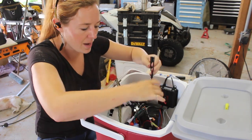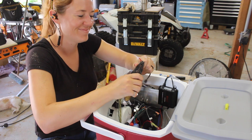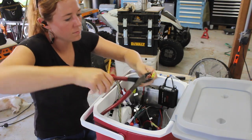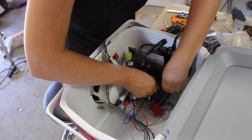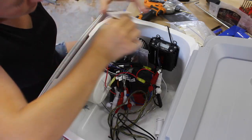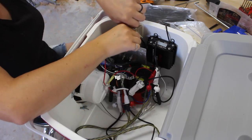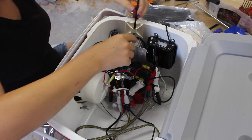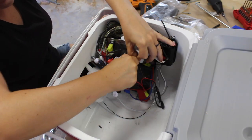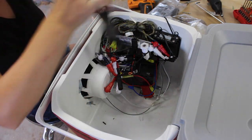It just so happens that Cody has a lot of motorcycles that came with trickle chargers, so I'm borrowing one. I actually took a lot of things from Cody's side of the garage for this project, but if you don't have someone's shop to raid, you can purchase these units off the shelf — I'll leave links to everything in the description. At this point everything is wired together, so it's just a matter of tidying it up using sticky-back wire anchors. Note that the receiver is not absolutely necessary — you could get away with just the amplifier and speaker because the amplifier has an auxiliary input you can hook your phone up to. However, having a receiver is nice because you can control it from the outside of the cooler, plus it has Bluetooth and radio options.